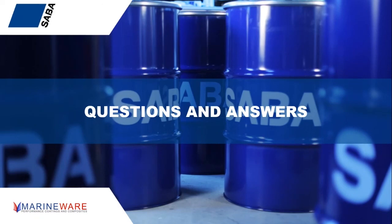Have we got any questions from people out there? We've just had one come in: there are a lot of ancillary products — the primers and activators and everything — do you need to use these for things like bolting down fittings, or for stuff that's got mechanical fastenings? As long as you're clean, dry, and free of dust, certainly where you've got mechanical fixings in place you should be okay. You'd obviously take more care if you're bonding something down structurally without anything else there. Most of the time, clean, dry, and free of dust and you're good to go. Primers are generally more about sticking stuff, and in the overwhelming majority of cases a primer isn't required. But if you've got a spare piece of material you're trying to bond, it's worth just running a little test to check.